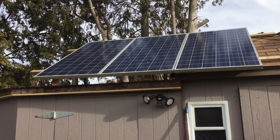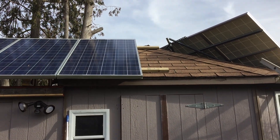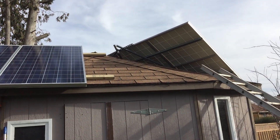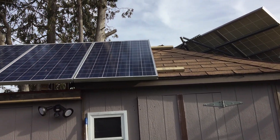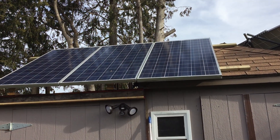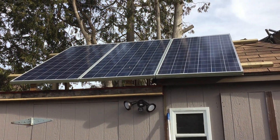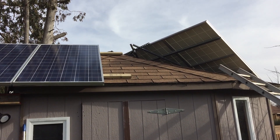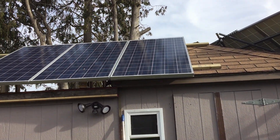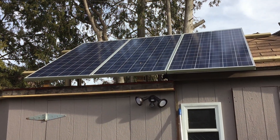There's about another 900 watts up there, and that catches the afternoon sun which is actually pretty helpful. I've still got the three Sharp 230-watt panels up there and they work pretty good for most of the day. These new ones are not adjustable — they're at about a 45-degree angle for now. The Sharps are on a car jack which I can move around a bit, which makes a difference.